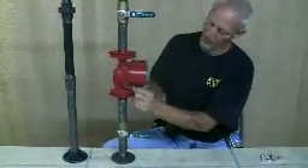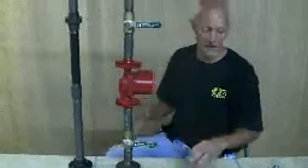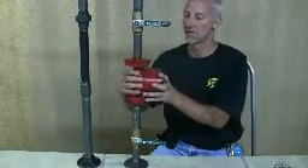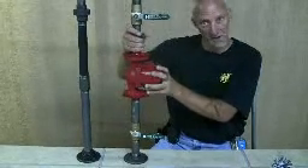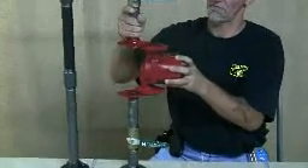I'm removing a brand new pump, so it's going to be a little bit easier for me. Some will be sticky or rusty, but you're not going to hurt anything taking the old pump out because you're going to be replacing it anyway. You just want to twist and turn it a little bit. You might have to lift up on the top flange of the pipe a little bit because sometimes it sags. Just lift it up a little bit and pull it straight out.